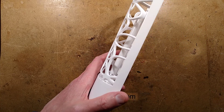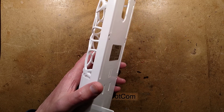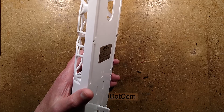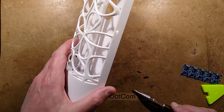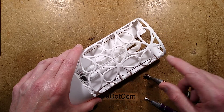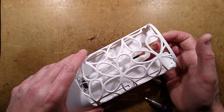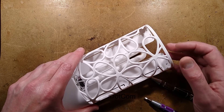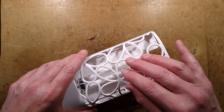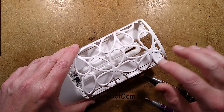The blacklight blue UVA tube is also used in fly zappers as well as this type. It's this safer area of UV that is just beyond human visual perception. The reason it looks bright blue is because it's got the phosphor, but it's also got the emission lines of the mercury spectrum that are visible to the human eye — I think it's green and amber — and that gives it that turquoise-y colour. But in reality, the important wavelength is not actually visible.